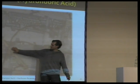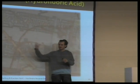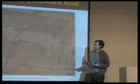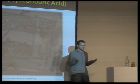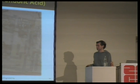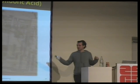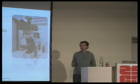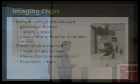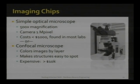And then these metal bridges that we have seen, they kind of break off the chip, especially if you polish them a little bit. So it's nice to combine this with polishing, but polishing has had better results for us, surprisingly. So however you get your layers off, you need to take pictures next, and we have been using a very standard microscope mostly, something you'll find in a high school lab. A normal optical microscope, not too high magnification for the feature sizes we're looking at.